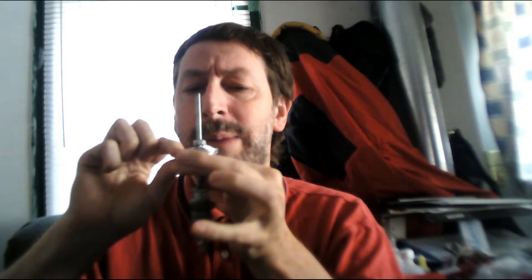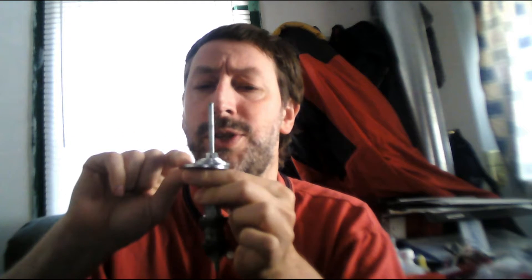These two are pipe clamps, and I've got them encased in this steel stick — that's an epoxy. I did this to make the pipe clamps strong so they would resist the bearing being removed, because otherwise the cement anchor was opening up. Then at the top are just a few washers. This particular washer is really crucial — it's about a quarter-inch wider in diameter than where the bearing goes in my wheelchair.